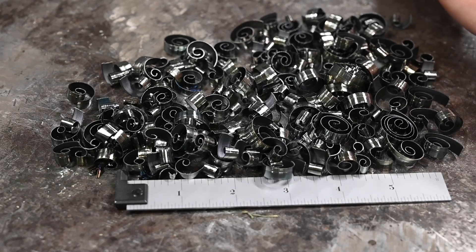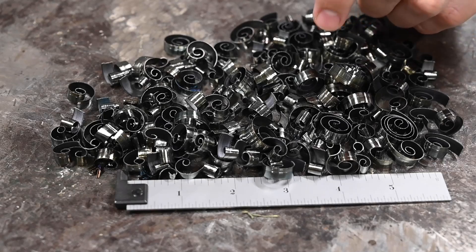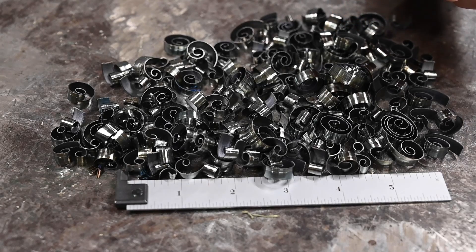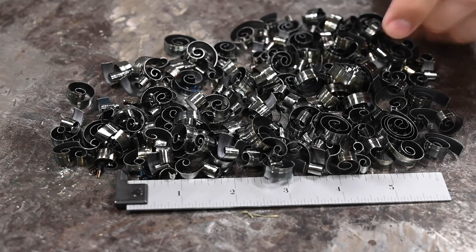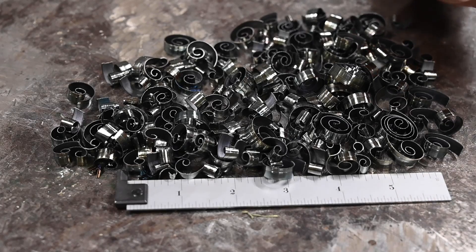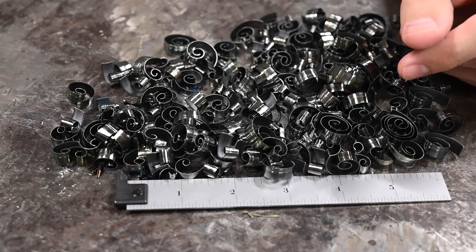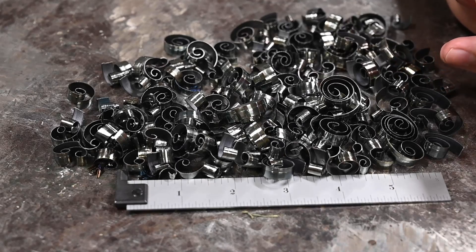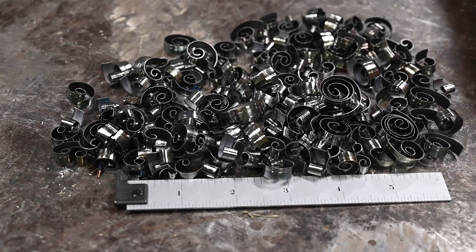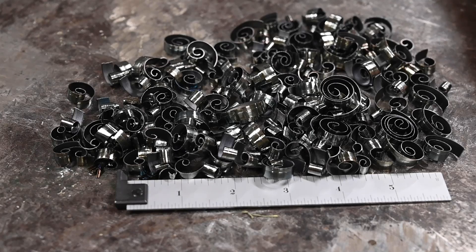I did test the cross slide — putting in a feed rate, then manually turning the chuck one revolution, and the indicator showed that's exactly the distance traveled on the cross slide when you put in a given figure into the gearbox. That doesn't surprise me at all — it's an all-mechanical, gear-fed setup, so there's no reason for things to not appear that way. Obviously there's something going on that I'm not understanding, so if you do understand it please let me know. I'm still pretty new to this and I've got an awful lot to learn.